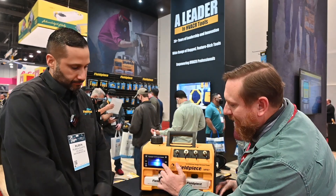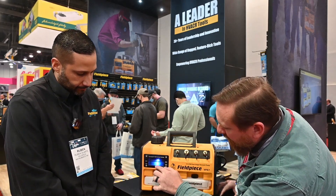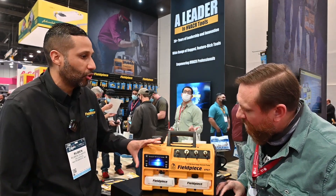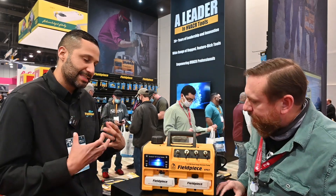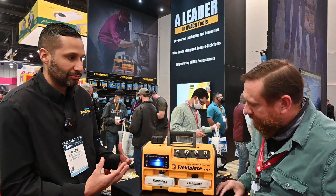So you can see your oil right here? Yes. This is the actual sight glass, all the way down to the bottom. So if there's moisture in it, you can see the moisture sitting there at the bottom. It's got a nice big sight glass. If you have clean oil, it's gonna be crystal clear. As it captures saturation and moisture, you're gonna see the oil turning dirty.